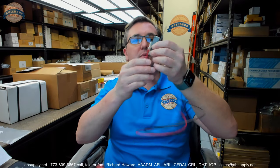I have removed the item from the packaging and it's just a standard micro switch. It's going to be a single pole double throw — normally open, normally closed, like a light switch. Single pole means there's just one pole involved, meaning there's not two sets.